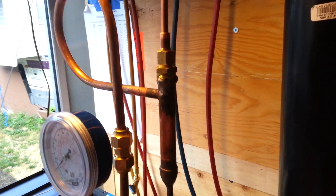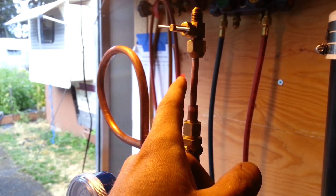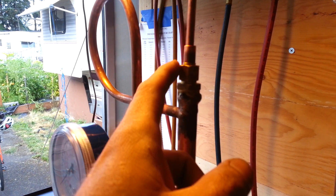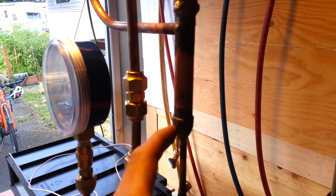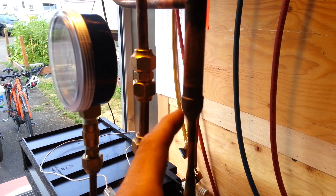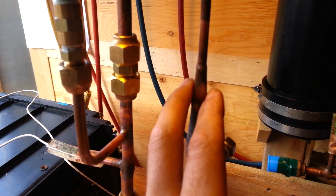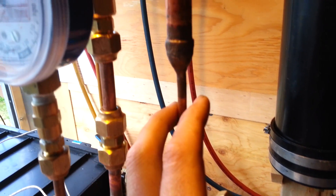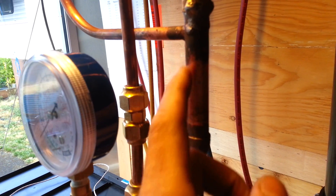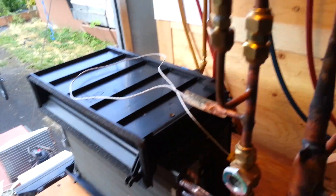In operation, the intention is that the high pressure motive fluid — high pressure liquid refrigerant — comes shooting through the first needle valve and actually comes down through a tube. This quarter inch tube and the 3/8 inch tube extend down through the center of the ejector. There's a small orifice with a capillary tube tip that ejects that motive fluid down through this quarter inch tubing, and then it diverges down here — this divergent nozzle opens back up to half inch. This creates high velocity and low pressure, creating a slight vacuum.